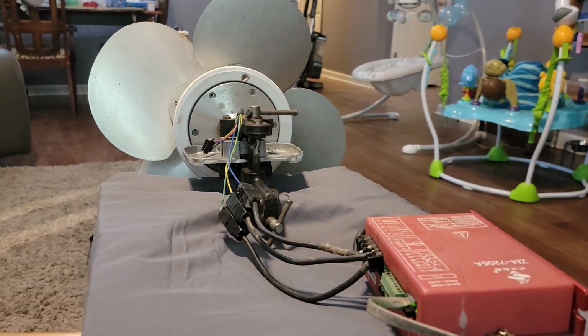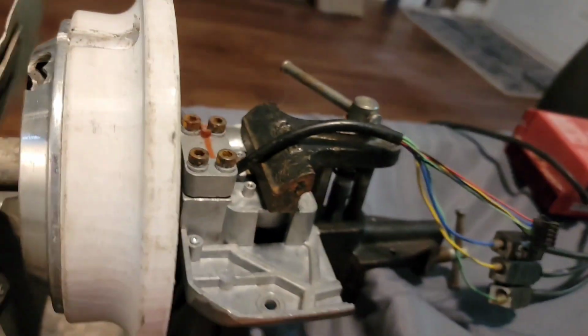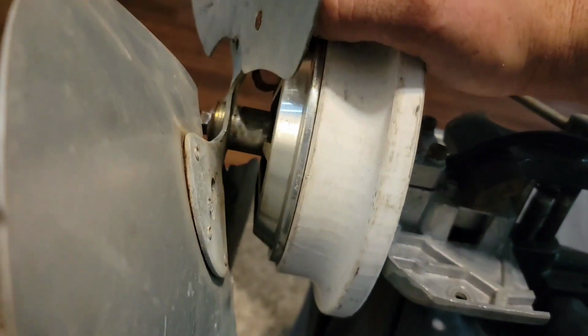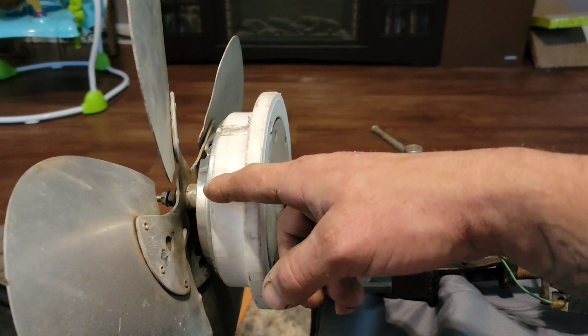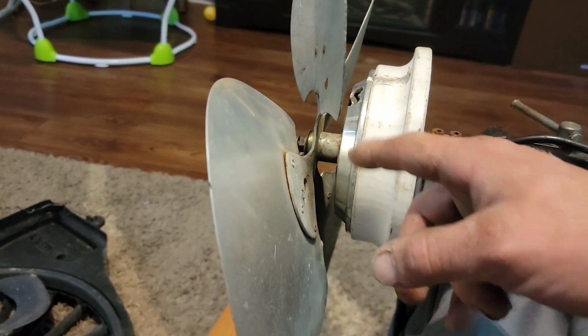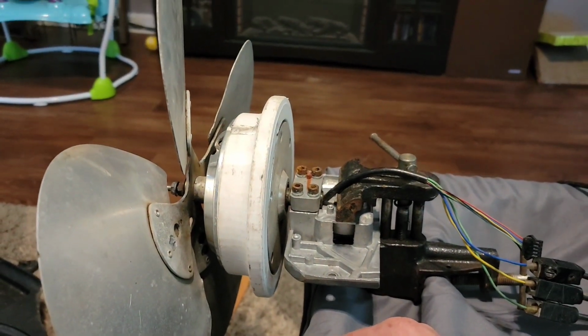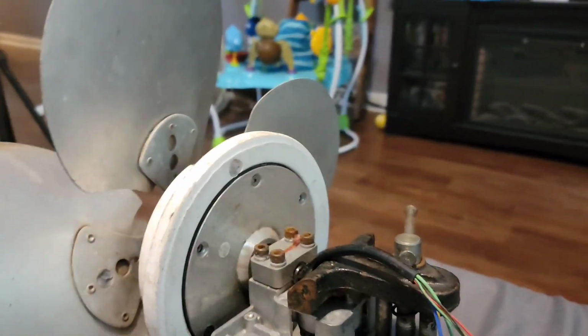So, what are we going to do next? Should I put the other fan blade on? I think we should. See if we can get some more wind off this thing. This just came off the little fan I showed you earlier. And what I did here is I drilled a hole directly center of the hoverboard housing. And then I actually drilled into the shaft in the center, because the shaft comes out here and then it goes into a bearing on the other side. And I drilled a hole right into the middle of the shaft, so that way the bolt on the other side would not hit the shaft, because it's right in the center. And then I actually had to round off the bolt, so that way everything will fit. And I'll take this apart, and I'll show you probably in the next video.